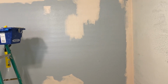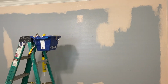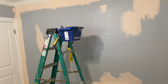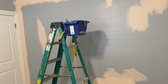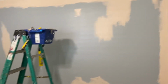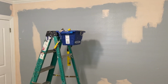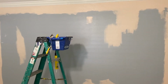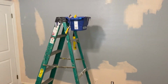I asked one guy that. I said, who told you that? Your dad? He says, I think so. I said, look at your second coat as you're putting it on. Are you removing the first coat? No. So why are you waiting until it dries? Let's stop doing things that Grandpa used to say to do. And let's start getting it done right. Sorry, Grandpa.